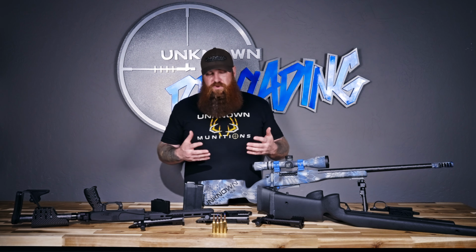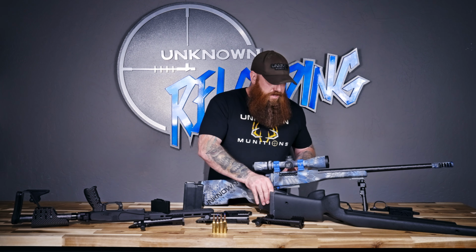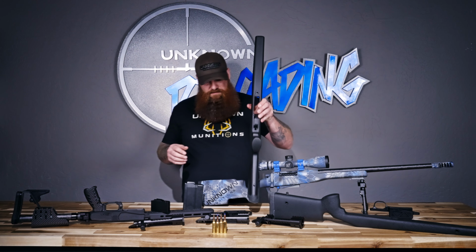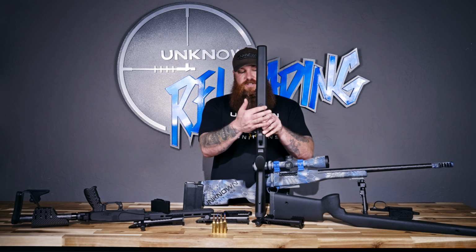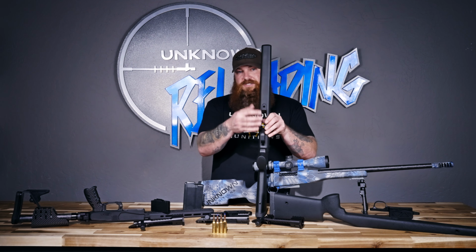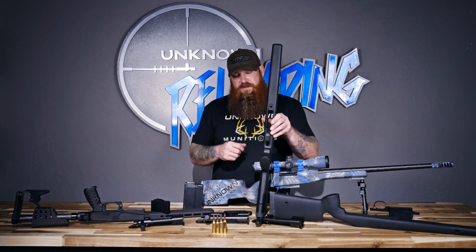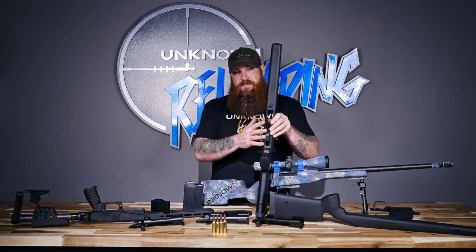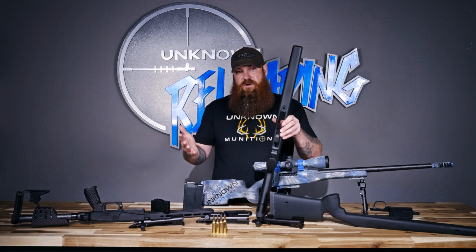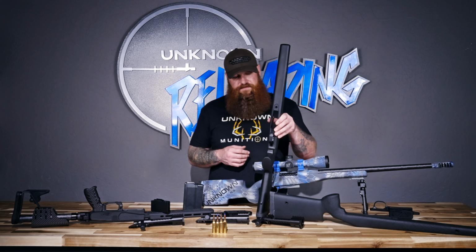So the next thing you would worry about is your bottom metal and magazine and what works with what. Everything that you're going to order for a medium is basically going to be a Hawkins M5. So M5 is, again, that shape up here on the front of the nose of the bottom metal. It's a nice rounded shape, not a parallel line kind of tongue action. It's definitely wider than what you would call a BDL. There's not really a BDL inlet that's available for a medium action, because everything for medium is aftermarket. Nothing was a standard, again, from Remington 700s.